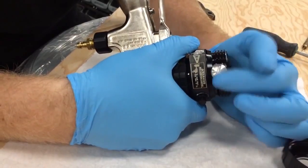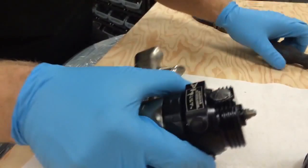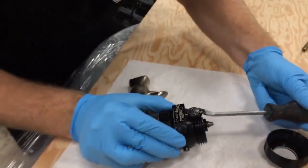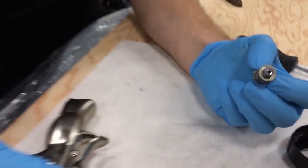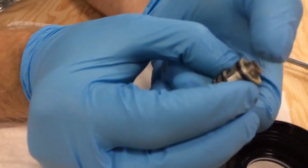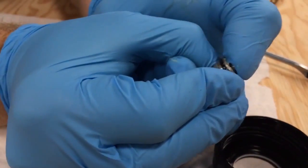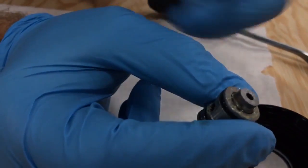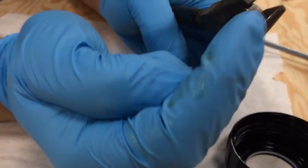The A one is labeled A — everything on the A side is labeled A. To pull these out, use a little flathead screwdriver and pry the side seal right out. The side seal insert is a tiny part that pops in and out and should spring up and down nicely. To pull it out, use a little pair of pliers and pop it out — there's an o-ring on there.